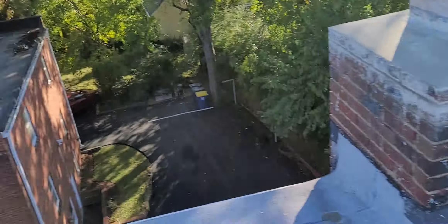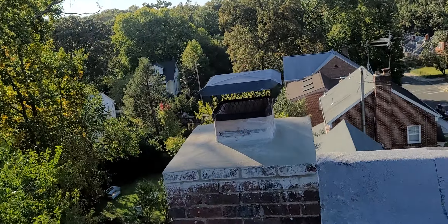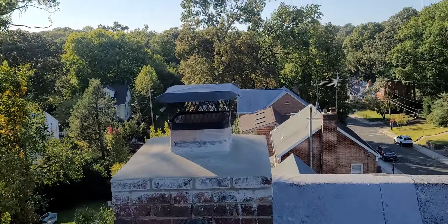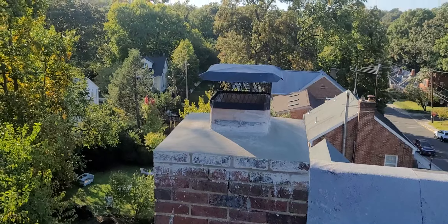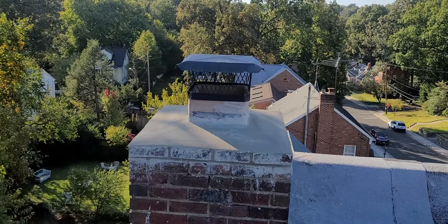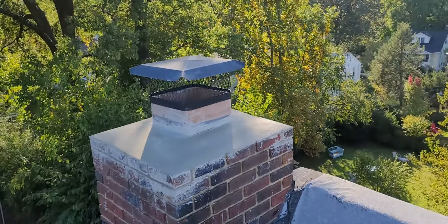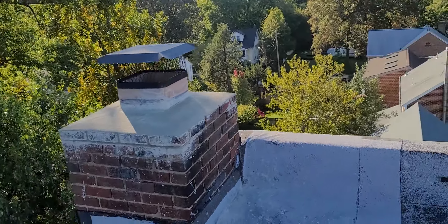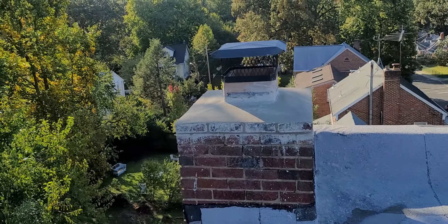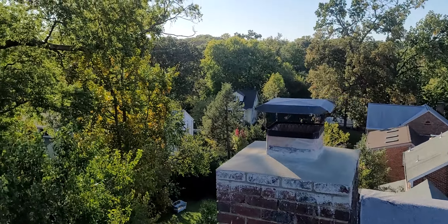I have one more thing to do tomorrow. After you're done with all this type of work, you let it set for the whole day. The next day, you come back with a little water, a little muriatic acid, a brush, and a scraper, and you clean up all that concrete residue you don't want on there. So I actually have another hour or two of cleanup work, but you have to let it sit for the whole day — you don't want to put acid on it right now, it's too fresh, too green.